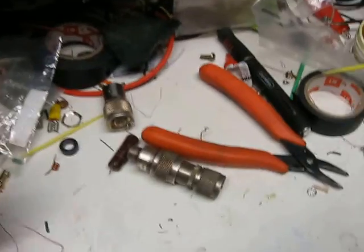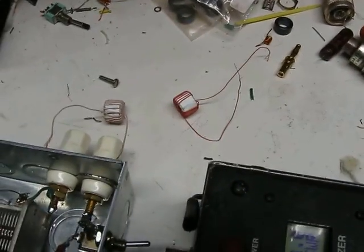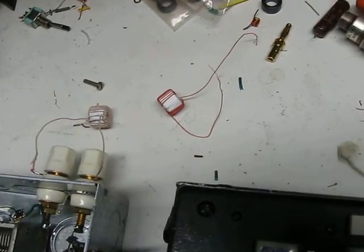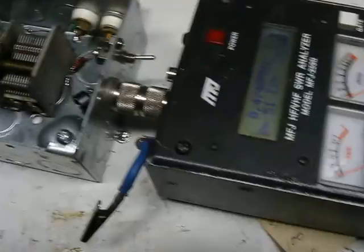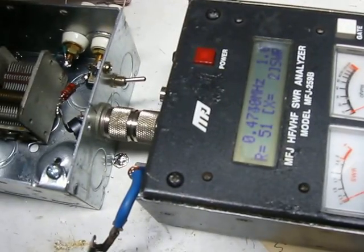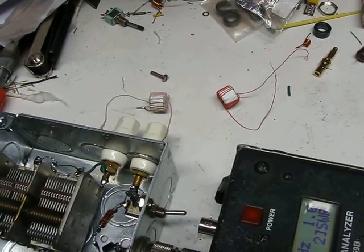And if I put this one in — another 150 micro-Henry inductor that's made with wire-wrap Kynar wire — I get 2 ohms. So the Q on this is half of the Q of the other one. And this is the inductor I'm using on my coupled resonator filter.